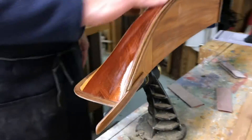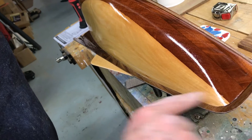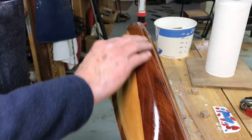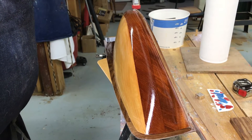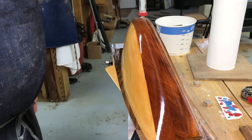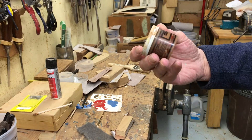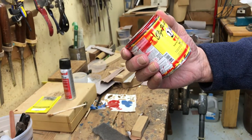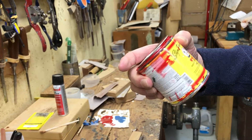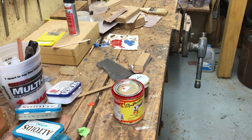After the piece was sanded, I put a coat of mahogany stain on the mahogany and just varnished the basswood and the walnut. You can get the varnish at a good hardware store, or use a urethane. For stain, use a gel stain or liquid stain — Epiphanes fast-drying stain works well. I also use teak putty; you can mix different colors to get the color you want. Teak putty is harder to find at a hardware store but available online. I use a lot of One Shot sign painters paint because it covers well, but any oil-based paint works — Rust-Oleum or anything like that, as long as it's oil-based.